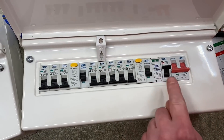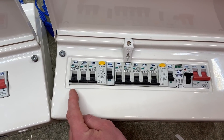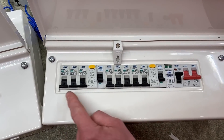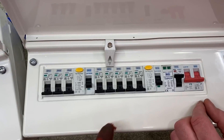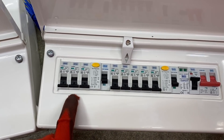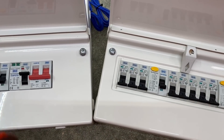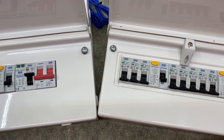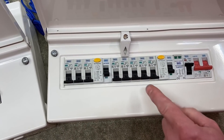This means when we're labeling up the stickers underneath the overcurrent protection devices at the end, we haven't got to hold the lid with one hand as we insert those stickers. This will be available from September. I notice there's a recess at the front here that isn't on the previous version - this step-down aperture has been added to the consumer unit to add more rigidity to the lid.